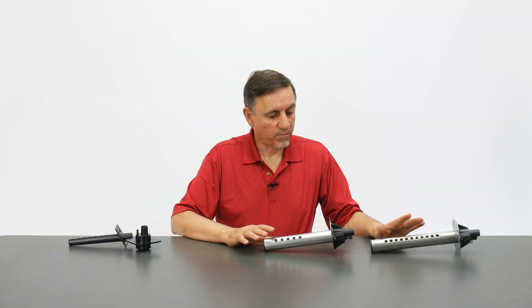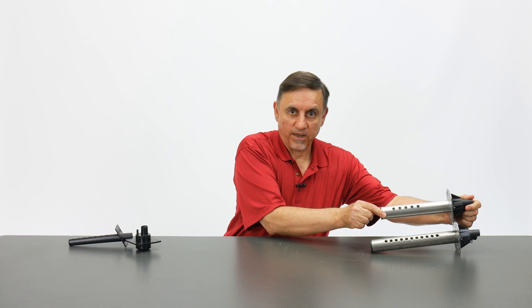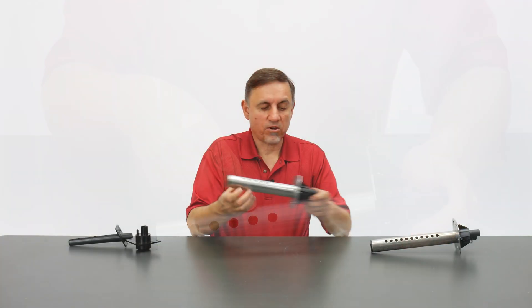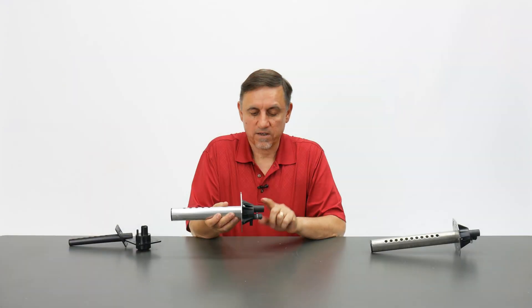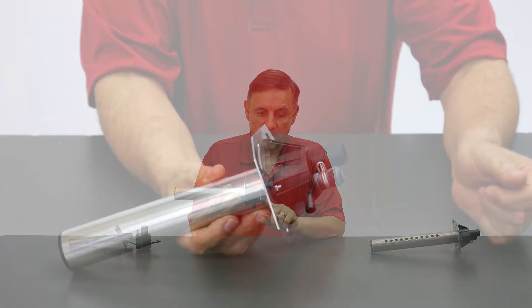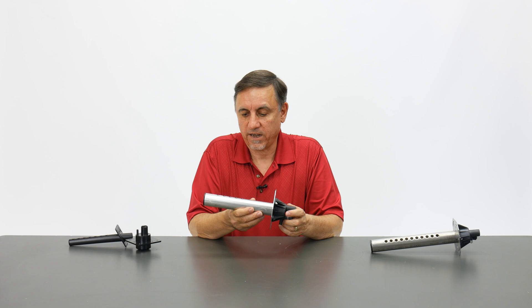These are the more commercial style steam distributors. We have two different sizes — essentially just different lengths. They're available in lots of different lengths and capacities. Larger capacity units would have a larger nipple for the steam hose. These also have two condensate connections — you can have one come out the bottom or connect it to the side, whichever works better for your application.